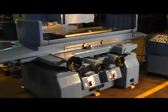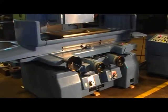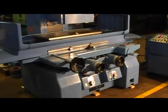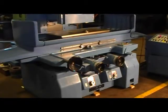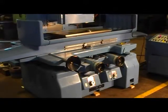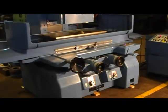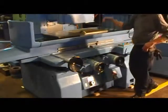Now we're in the index mode. So you see indexing the table on the Y-axis — both ends are in there. Every time the table comes to either end of the stroke, it's indexing either forward or back. It's also indexing down vertically.